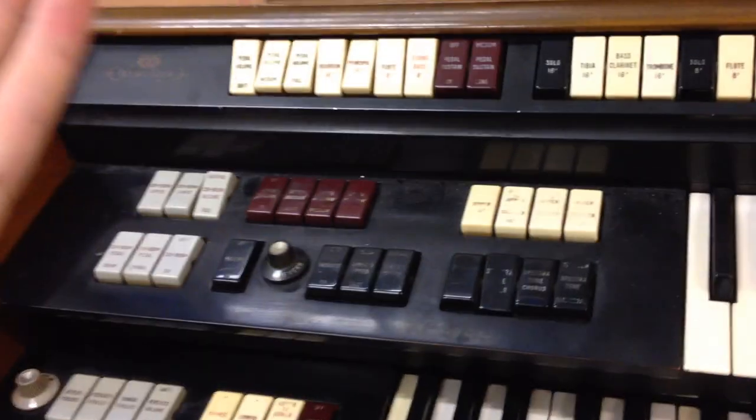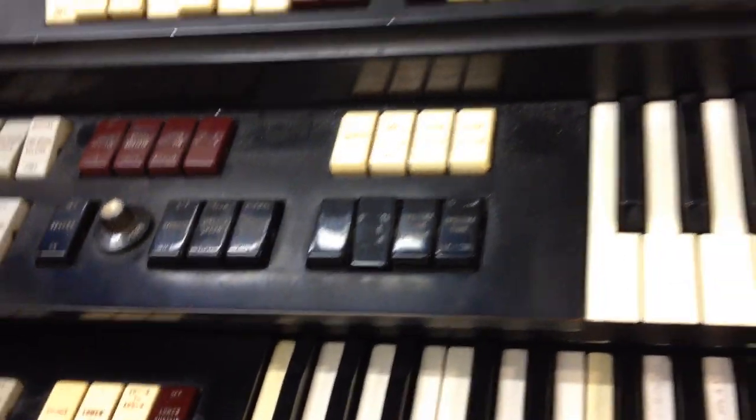this rises up and you can get inside all of the switches and just get a piece of fine wet and dry sandpaper and just scrub the contacts on those switches to clean off the rubbish and give them a good electrical contact. You could use switch cleaner as well. I don't like using it myself, but you know that's also a really good way of getting them going.